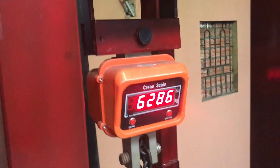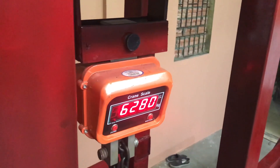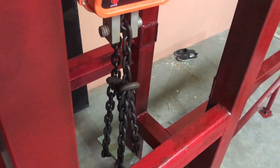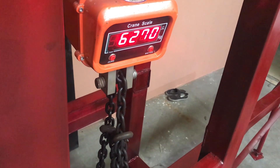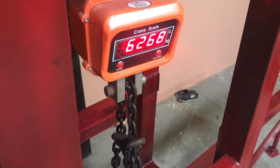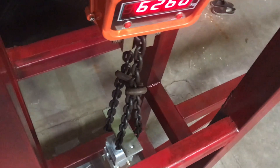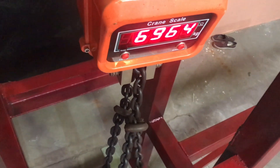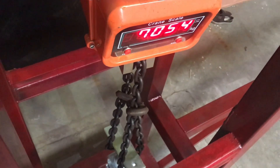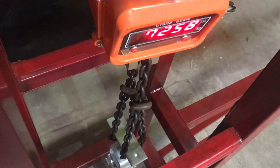It's just started to move up a tiny little bit there, so it'll probably keep sliding up. This is on a four mil thick steel post. If your post was stronger — if you've got a five mil thick post — it'll be stronger steel, so you should get a better result. But that's six and a half ton — let's see whether we've got any more in this. The thing I like about this is that when it does fail, it's still holding that much force — still holding seven ton of force. I think seven ton would probably pull the stump out of the ground. Seven point three — is it sliding up, mate?